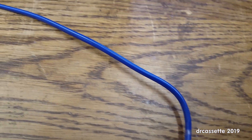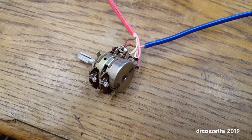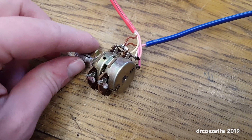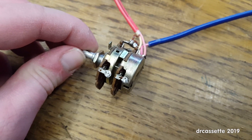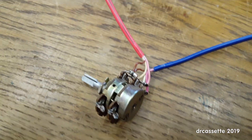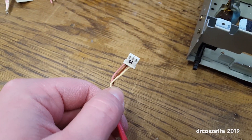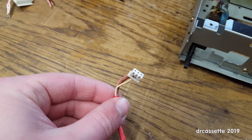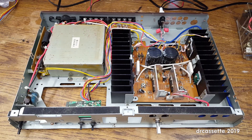This then goes into a long shielded cable, which used to be part of the amplifier. Here is a proper volume control — a 250 kilo-ohm potentiometer. It does have a center tab for a loudness circuit, but we don't need that. Then another shielded cable, and the plug that originally plugged into the main amplifier is going to plug into the main amplifier again right there. The input circuit has been installed, and coincidentally there was a hole in the chassis right there that was just the right size for the volume control.